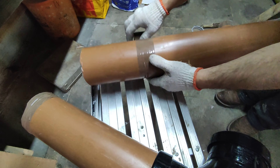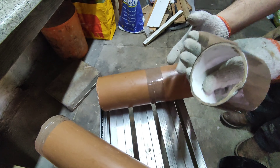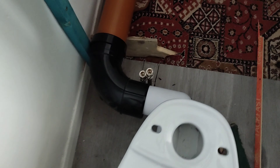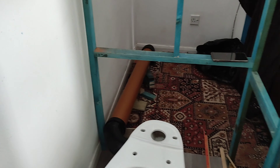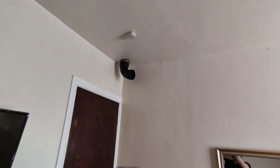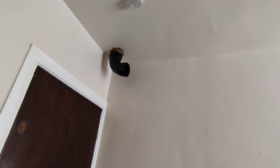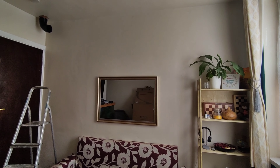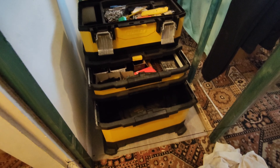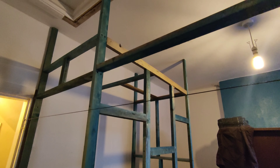Same thing applied to the bigger pipe - cut off the section you want with tape to follow around. Once I cut those off I had a 90-degree joint and then the section to go into the toilet, which goes directly down into the floor. I made a hole in the ground in the upstairs room which then pops out downstairs along the top of the wall. There's no chimney in that room, so I'm going to take that pipe all the way along the wall and out through the external facing wall, which then drops it to my garden and gets joined onto the manhole cover outside.